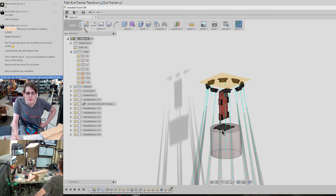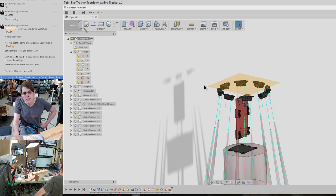And then, I haven't actually modeled it yet, but my idea would be that the wires from the winches, or nylon ropes in this case, would come in at an angle between horizontal and fairly vertical, depending on how up and down the robot wants to be. And I would set that to come in at some distance from the very center axis, where that distance would determine how much orienting force I get, but also how much unwanted orienting force I get.